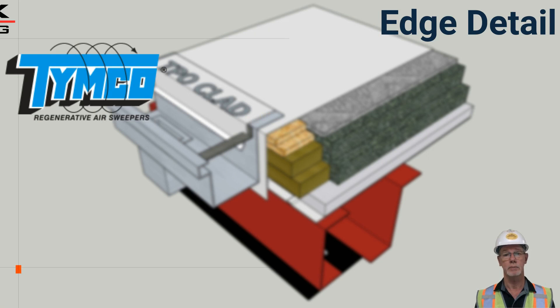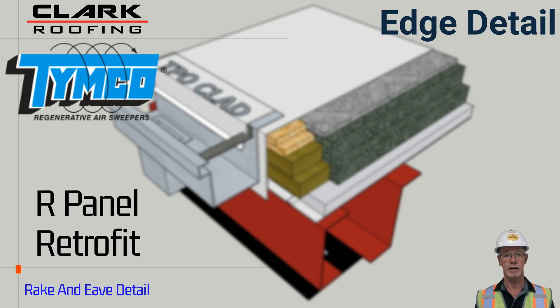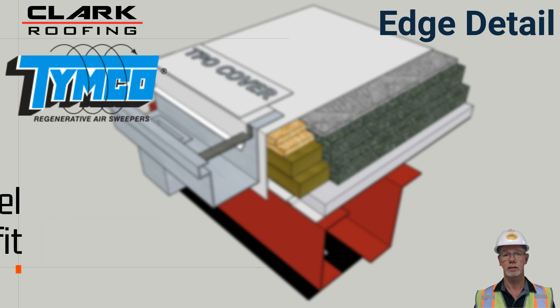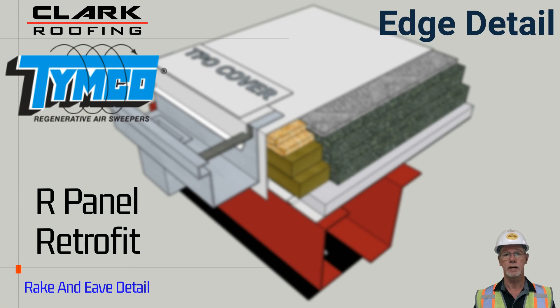We then install a special membrane-coated metal — 24-gauge galvanized and coated with a matching membrane. This allows the single ply roof system to weld directly to the membrane-coated metal, ensuring a watertight connection. The final step of the roof to drainage connection is a strip of membrane that is hot air welded to the clad metal and the roof field. This forms a watertight connection and assembly as a whole.